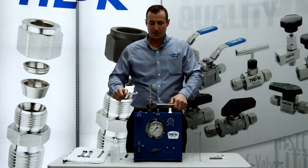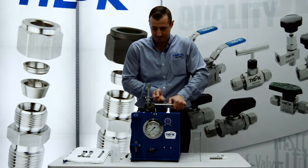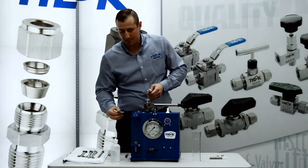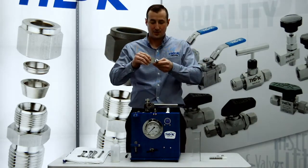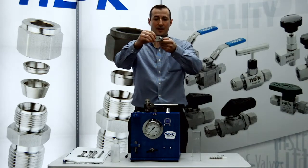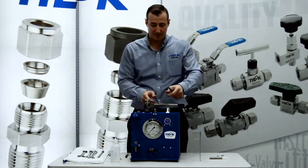That's about one full turn right there, so I want to go a quarter past that. I'll take my half inch no-go gauge, and you can see since that gauge won't go in between the nut hex and the body hex of that fitting, I know I've gone far enough and I have a good seal.